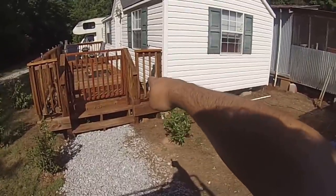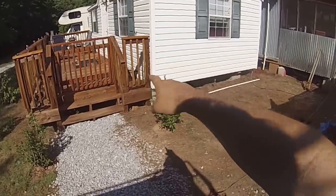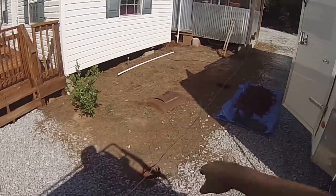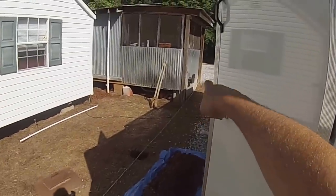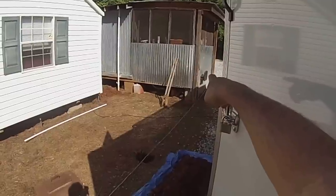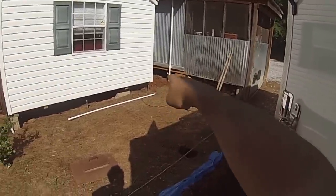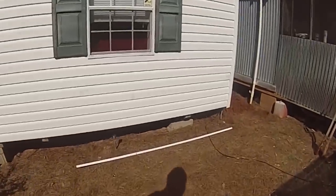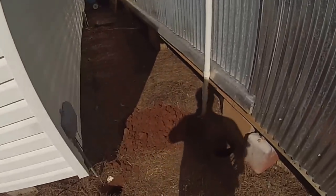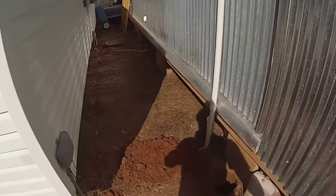This railing is going to be somewhere between 36 and 40 inches high. So I am going to scab on to that 4x4 post corner. Got a new post going in there, a new post going in there. Then I am going to scab on to the corner there beside the water spigot. Then I have got two 4x4 posts that are going to go in there. So two 4x4 posts here and this will be 36 to 40 inches high.